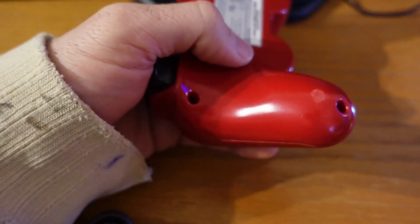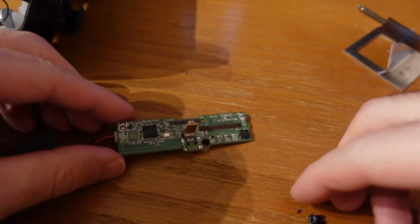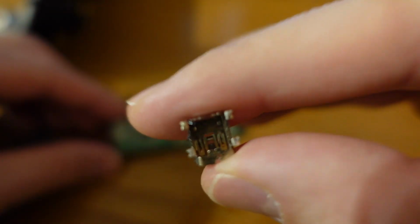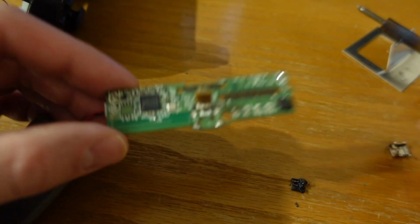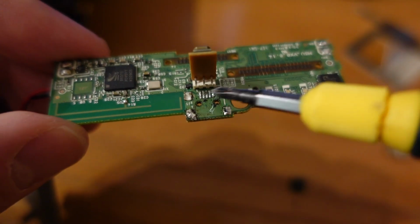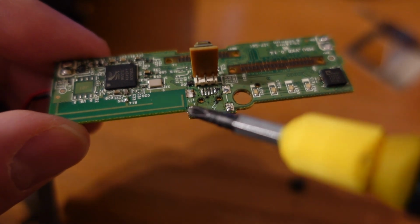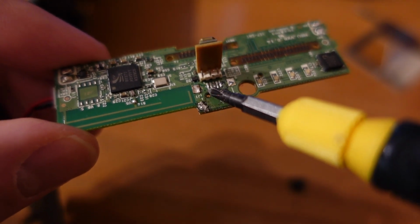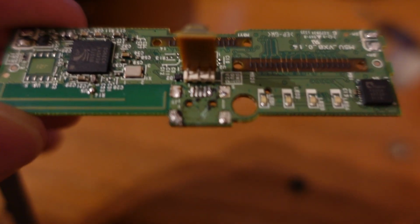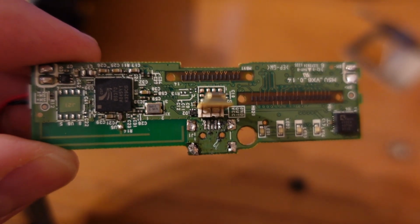And you can see that this would be harder to take off than those little side wires, because there's the 4 corners that need to come off, and then there's all the pins that also need to line up, and those are all soldered on individually. So it was much more difficult to get that little charger off than it was just to get the 2 wires off the sides, for sure. So if you could avoid doing that, I would, and I would just use the circuit board instead of worrying about going to buy a charging port separately.